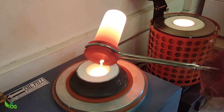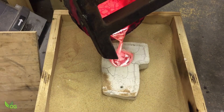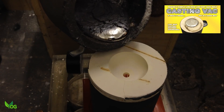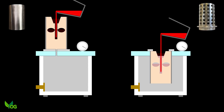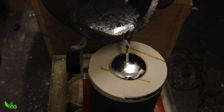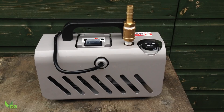When it comes to the pour, once again you'll want to vacuum your flask. I've tried lots of ways not to use vacuum and none of them achieved suitable results. But when I finally came up with my homemade vacuum chamber and pump, my results changed dramatically for the better. The purpose of the vacuum is simple — the resin print has burnt away, leaving a print-shaped hole inside the plaster. Molten metal is poured in but has trouble filling all the nooks and crannies. A vacuum system pulls on the metal through the plaster, removing trapped air pockets and pulling the metal into every crevice. When starting out, my homemade system will serve you well, though if possible replace the plastic pump with a proper vacuum pump, as manual pumping is a bit of a pain.